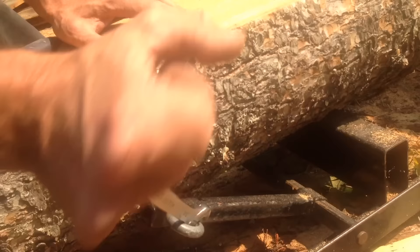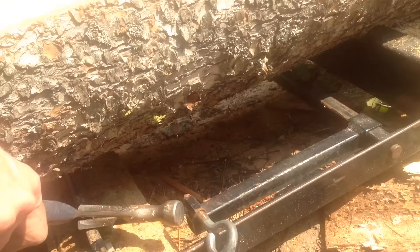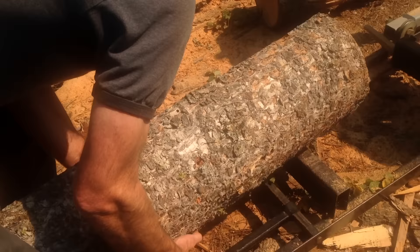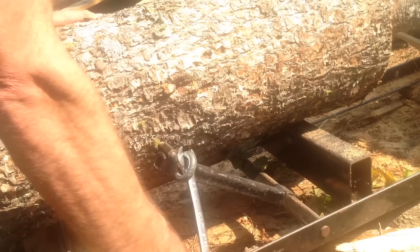I just reverse the clamp and back that eye screw out. Give the sliding part a little tap, and then make sure and drop it down. I'm just in the habit of making sure it drops all the way down, because if it's up on the track and I'm not using it, then the saw will run into it. For the second side, that clamp makes a whole lot more sense because it's meant to register against the flat side. That clamp is 90 degrees to the saw bed and therefore 90 degrees to the blade. So theoretically, if you have that set up and clamped against that flat side, your second cut is 90 degrees to your first cut.